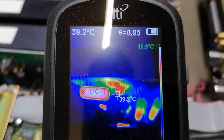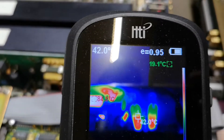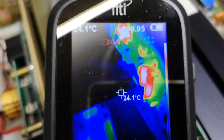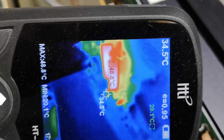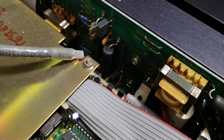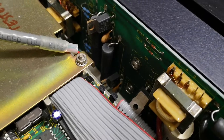There's a capacitor in series with this resistor — it's also a good idea to check whether that capacitor is running really warm, because that's a very nice thing to check for and fix. And over here — I was too close with the camera. That's also a primary-side snubber — you can see some capacitors and then the resistors.